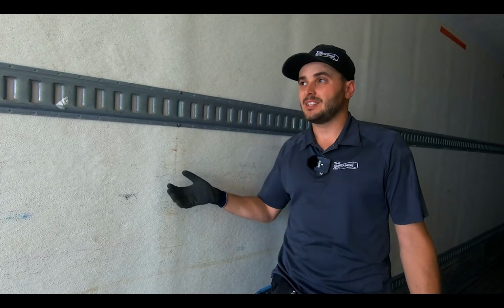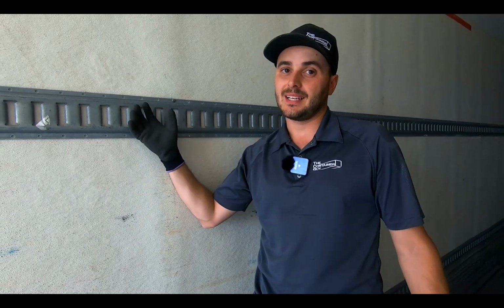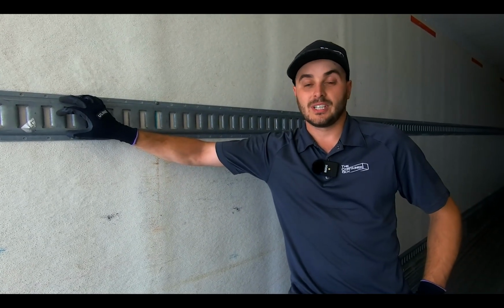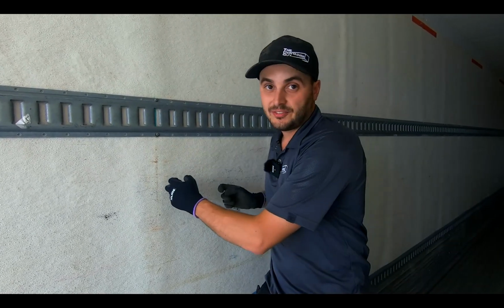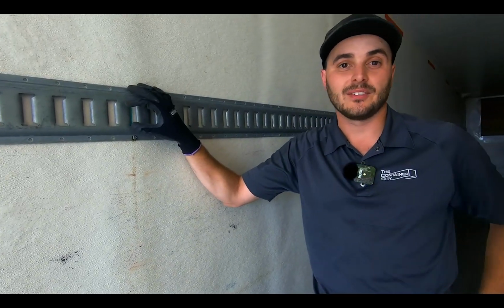If there's something heavier that needs to be hung from the wall, often we'll still line it with strut, say to hang a heater or the panel, transformers, whatever. Something that needs to be wall mounted that's heavy. You don't want to just go right into your fiberglass wall. You'll want some structure there. But all in all, yeah, cheaper again for the electrical as well.